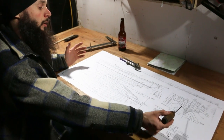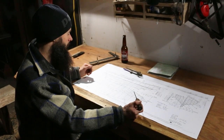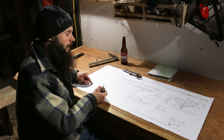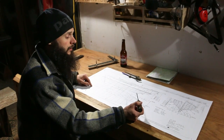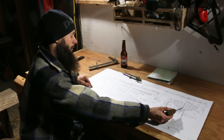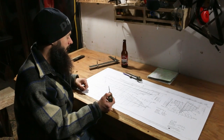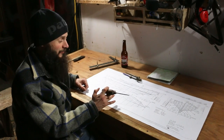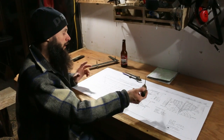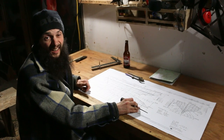If you drew all three views on their own floor you would need a massive floor, so you draw all three superimposed on each other - it starts to get confusing, but on our lofting floor you'll see the boat in profile view, half breadth view, and frame view, all in different colors. Once you have all three views down you need to compare them and make sure the frame view matches the half breadth view and the profile view. If it doesn't, you have an error somewhere and need to hunt it down - very time consuming the first time. Once all three views are fair and agree with each other, you can pick up the patterns to build your boat. That, in a nutshell, is lofting.